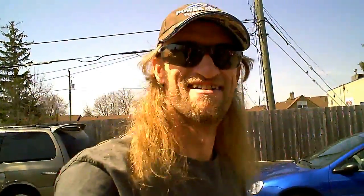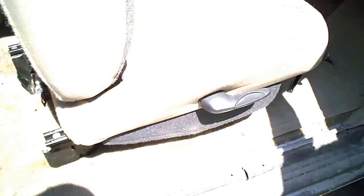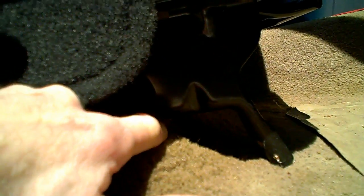The bolts line up at the back — you can see daylight through there — but the problem is holding the face in. Now if I push down, it holds the bracket still. We have that much space on the front, so I was thinking maybe if I weld a bar from the bottom here, all the way down on that angle, and then slide a bolt underneath, it'll lay right up against this metal.